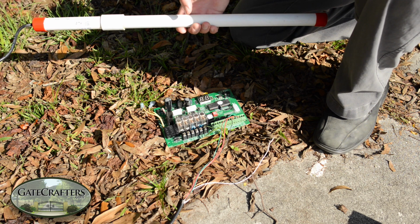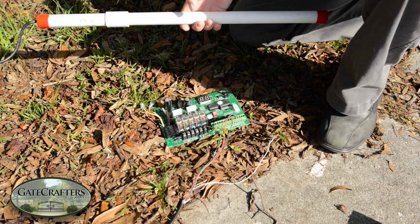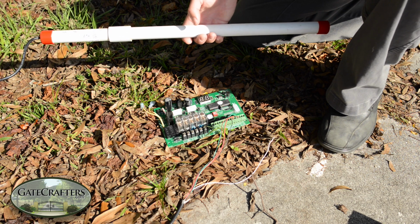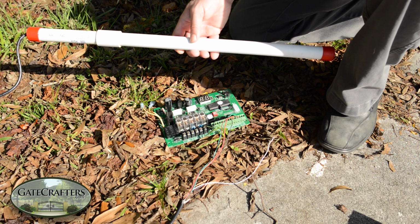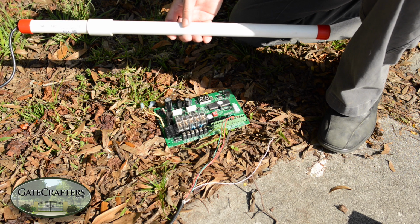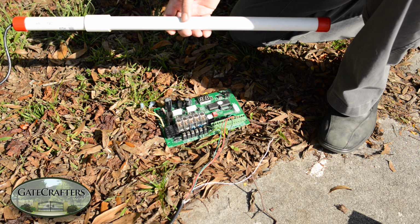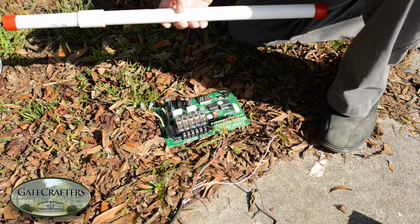Their wiring is different in terms of colors and number of wires. However, when you're having an issue, and the issues I'm going to discuss, they can all be troubleshot the same way. What an exit sensor does is it detects moving metal. Moving metal is simply disrupting an electromagnetic field around the exit sensor. So one thing to understand about that is it can be other things that are disrupting the magnetic field.